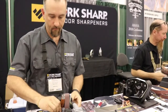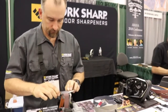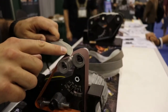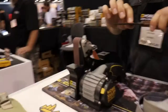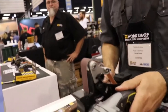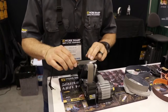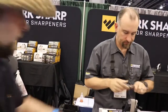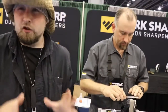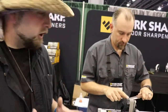Guys, these work wonderfully for people who don't necessarily know what they're doing with a whetstone, or maybe just don't have the time. A couple passes on the 120 grit drew a really nice burr, so that's my indicator I'm ready to go to the next grit. Now as he finishes this up, I want you all to notice just how quickly he changed the belt on this machine — he can change it faster than I can even set it. That was probably about six seconds to change from a coarse to a much finer belt. He's going to work his way down as he works the material into a sharper and finer edge.